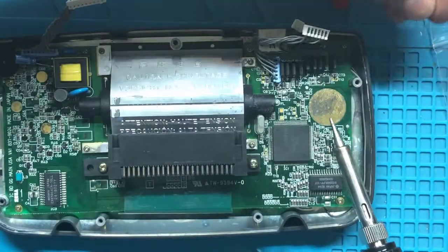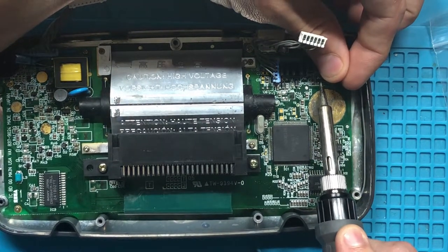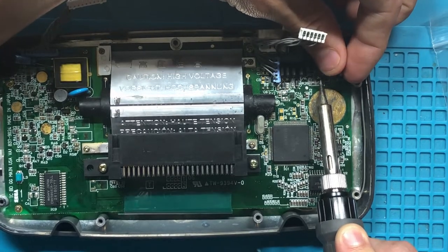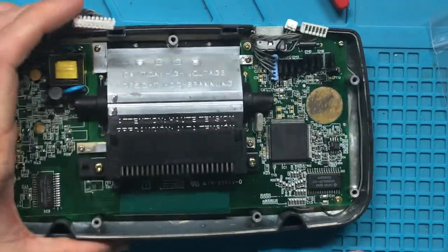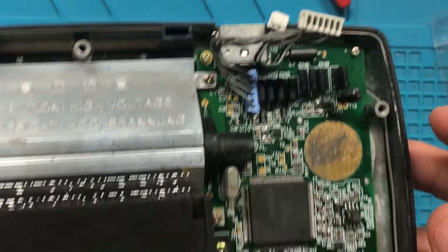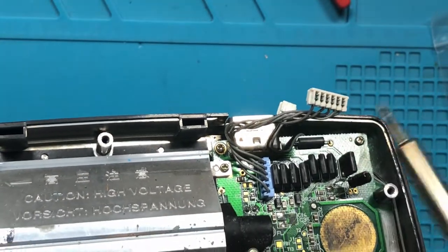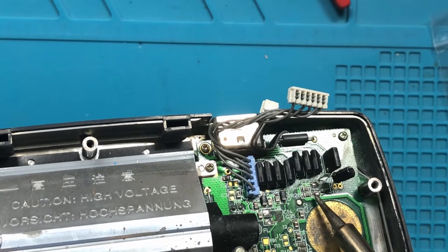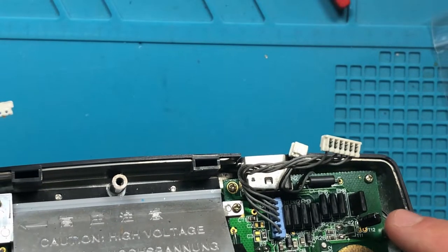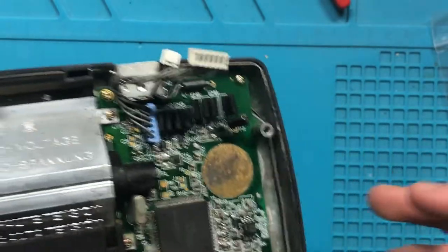Alrighty. So my hand might get in the way, and that's okay, because I will explain how I'm doing it in a second. What I'm doing is on these contacts, if you can see, let me stand up right. So this is what I just soldered on, right? This little blob right here, that's solder. You want to get that hot to where it looks molten, and then you'll pretty much stick this on top of that, and it'll sink to the bottom of there, and it'll attach.